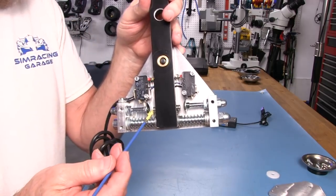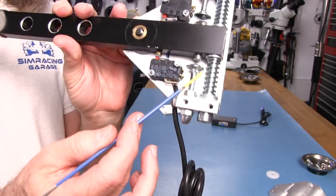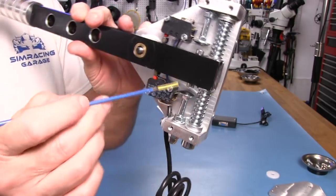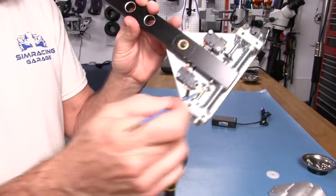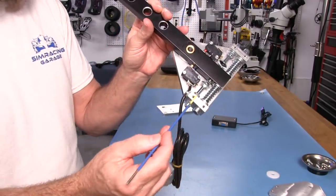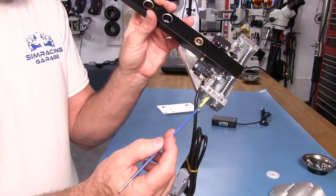The stops themselves are actually carriage bolts — you can see the little square side on them and the smooth piece on top. He's going through this 10mm thick plate and capturing it on the other side with that acorn nut.